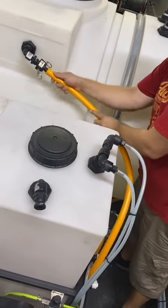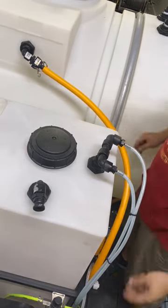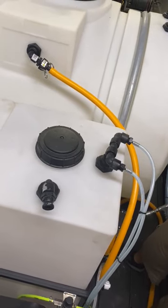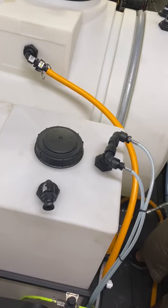You'll move it over to your water tank, slide these down, you'll open up your SH valve and flush your system out. And at the end of the day, you have no SH left in your lines and it will make your proportioner last a little longer.